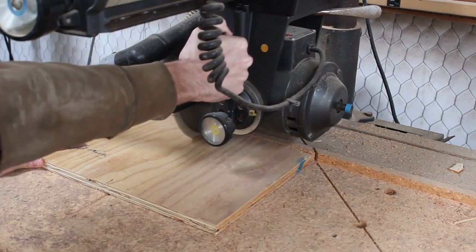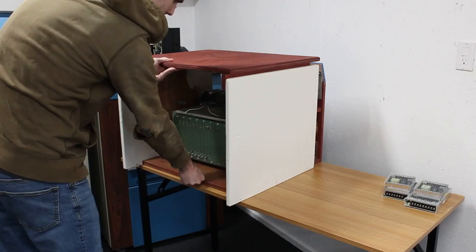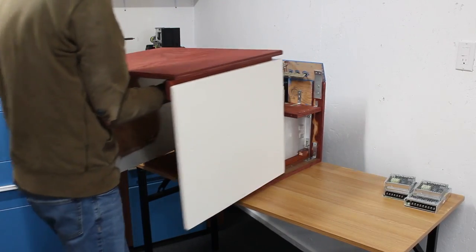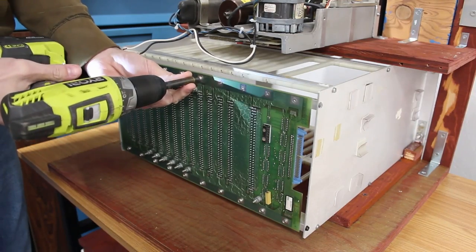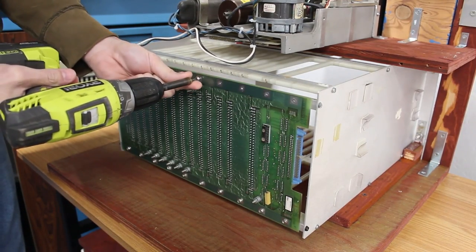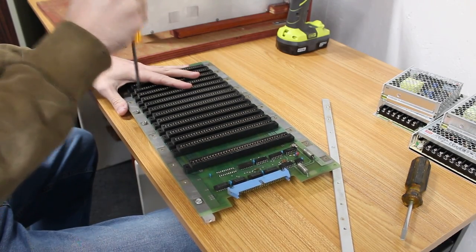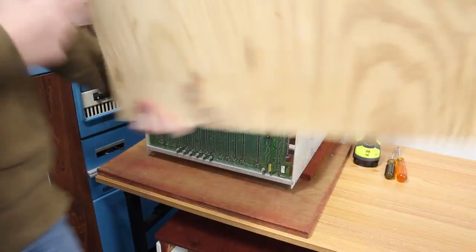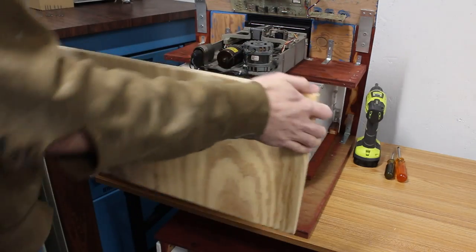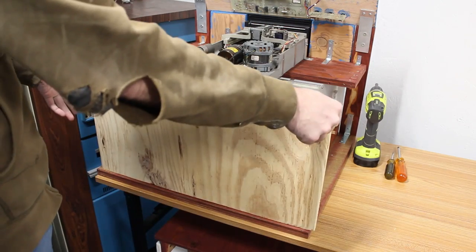Give it a quick chop on the radial arm saw, then let's get the actual side and top off — we'll remove the screws holding the side panels on, lift the whole unit off, and set it below the table. Now that I have easy access to everything, we'll remove the back plane and move it to the proper side of the mounts, because I mounted it backwards last time, then get it mounted back into the card cage.